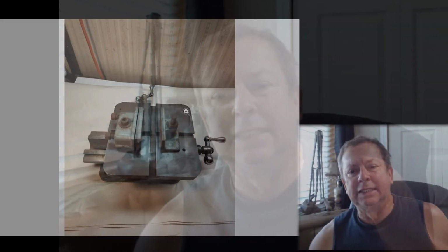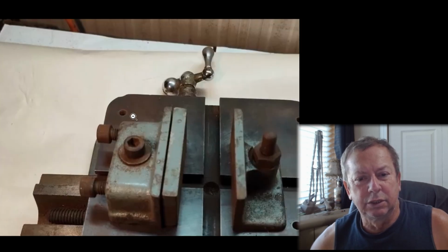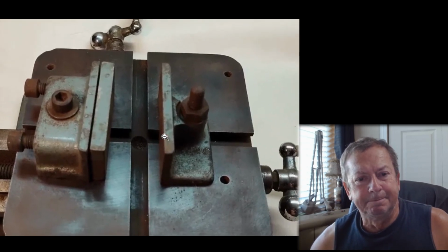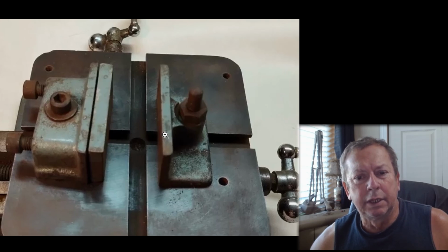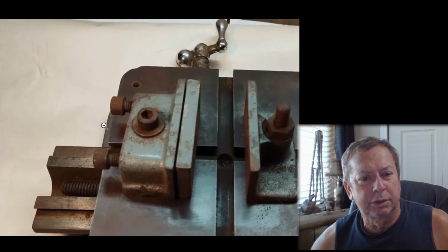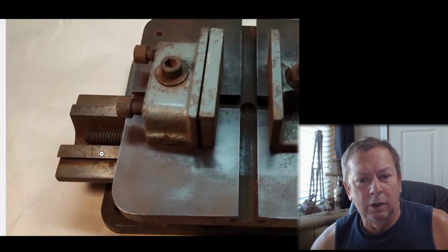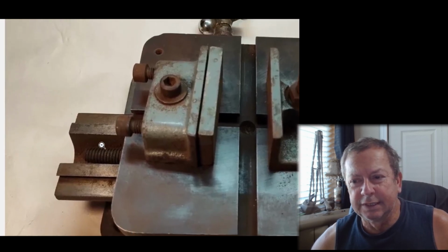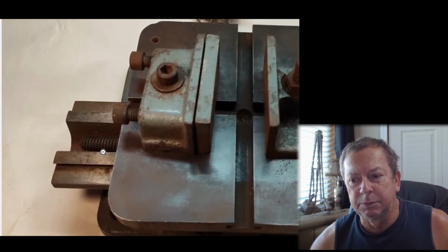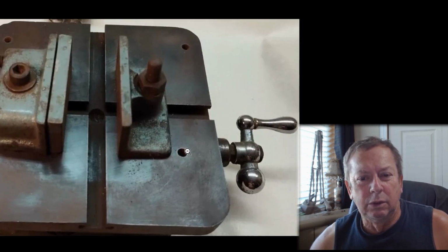Now the advantage that this does have is this does have the vise jaws that go here. It's got basically an angle plate here, and then this adjustable vise that I suppose we could look a little bit closer. These screws tighten it up. So I've been going to reproduce these, but I haven't done it yet. You know, one more project. These are probably not the proper screws to hold either of those down. They did have an Allen head here. Doesn't look like it has the guard that went on the end here, which was the same guard that fit the 6-inch Atlas machine cross slide to cover that portion of the screw. Rusted out, holes there.